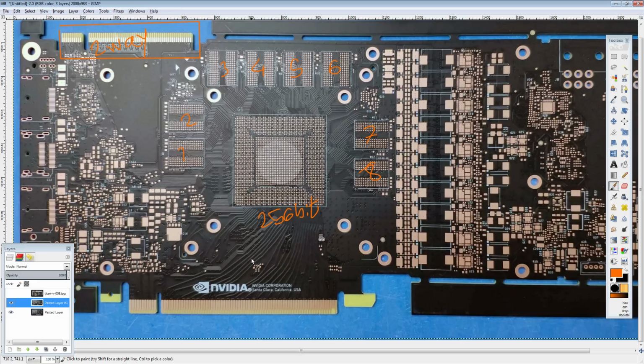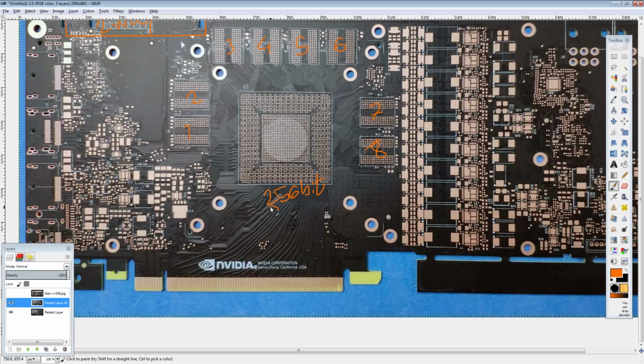I do realize that over time, the 980 and the 1080 have pulled away from their predecessors, as basically, the newer cards support newer technologies, so they're getting faster for more modern titles. But when they launched, they were barely faster. And this, I think, would be exactly the same story. The 1180 will launch, and it'll be like 5 to maybe 15% faster than a 1080 Ti. I honestly wouldn't be surprised if this was slower than the Titan V. That would not surprise me whatsoever. So, yeah, it's a 256-bit memory bus, and it's going to be running on GDDR6, because otherwise this would be really slow.